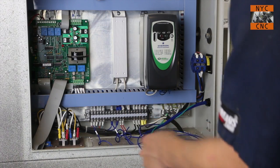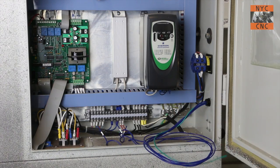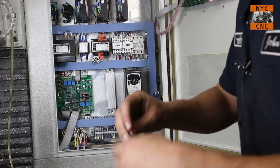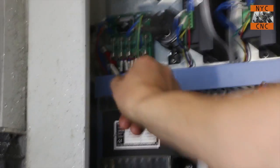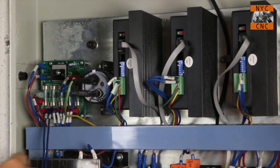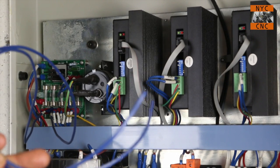Take your green wire, shorten it up a hair if you want to, and put this ring terminal on the end and clamp it to that ground bar right there. Take the wire with these two ends marked 324 and 325, fold it in half and cut it in half. Now we're up here in the top left of the cabinet. Wire 325 goes to the one marked A minus. 324 goes to the one marked A plus. I've got a Series 2 and the same is true for Series 1 — they're right up here. If you've got a Series 3, lucky you — apparently the same thing, I just can't point to it. Installed. For me that means 325 is on the left and 324 is on the right. You've got the two loose ends still to deal with.